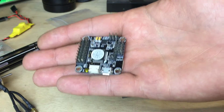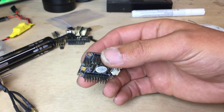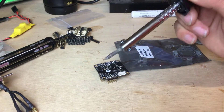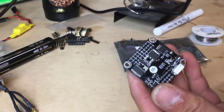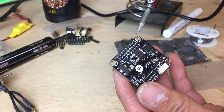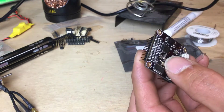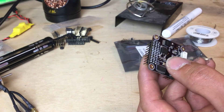The v1 board is very easy to solder up. The reason is because they come with all the pin headers and you literally just cut them or break them where you want, put the pin headers in loosely upside down on the board and off you go. A massive tip is that when you go to solder the pin headers on, don't try and solder them all in one go. Just solder up one corner and then the opposite corner, because if the pins aren't flat on the other side it's a very simple job to just heat up one pin and make it flat.